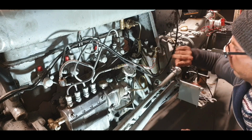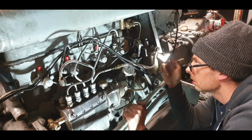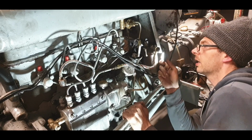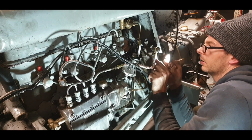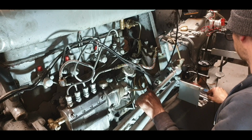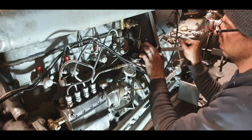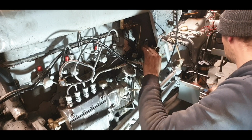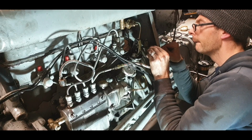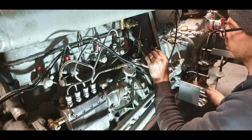The fuel filter is self-sealing. So inside of that, the Dowty washer is leaking there. So we'll have to do a little bit of loosening on it and just move the Dowty washer around a little bit, getting it to seal a bit better. Sometimes that's all it takes.